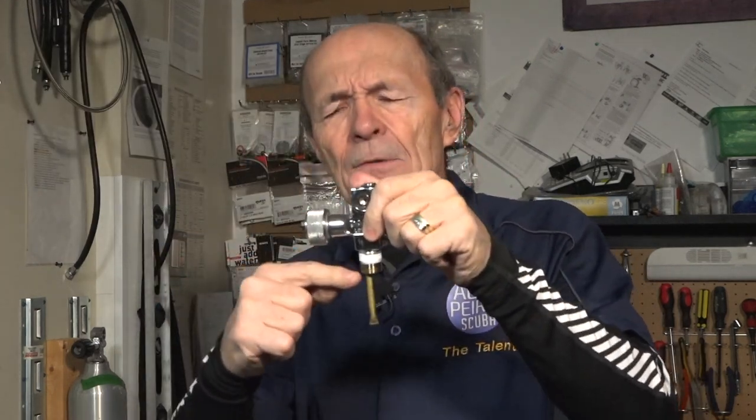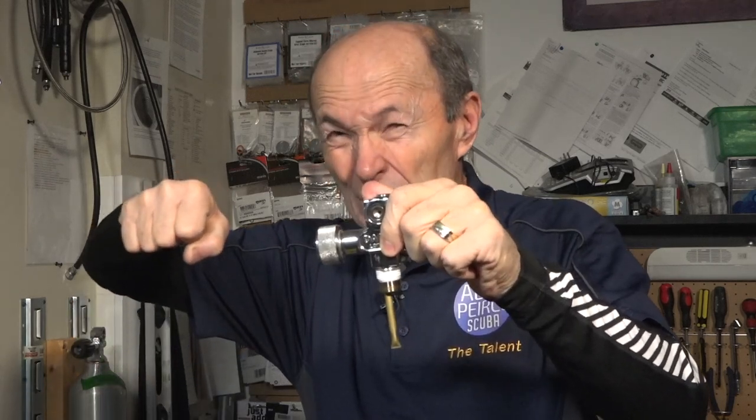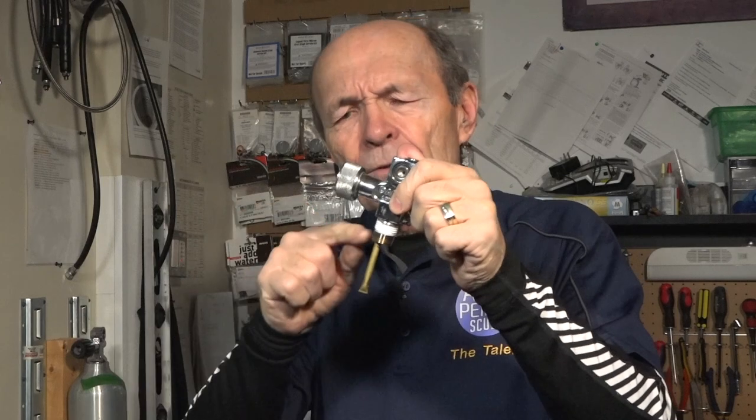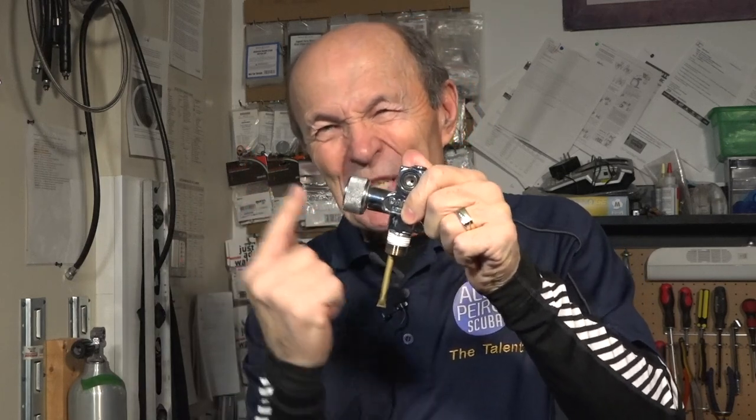So as the metal to metal happens, sometimes they can gall in there and the threads can strip, or the tank threads can strip. So the first thing that the Teflon tape does is it lubricates it slightly so it spins in more smoothly. And the second thing is it actually creates a bit of a seal. It helps it to seal. So here's what happens. Let's assume we want to install this half inch valve in our tank.